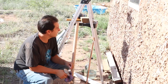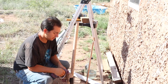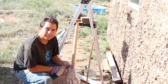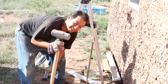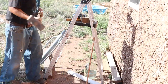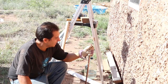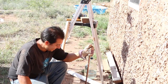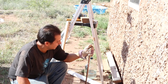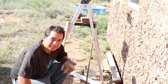I got it about as far as I could with the T-post pounder. When I got to about the three-foot level I wasn't getting the leverage I needed. Now I'm going with the sledgehammer — I'm going to persuade the heck out of this until it gets where it needs to go. I won't bore you too much watching me pound into the ground — not very entertaining, not very informative — but it's going in slowly, just going to take a little time.